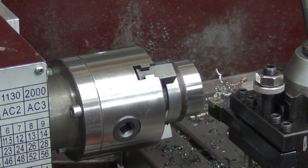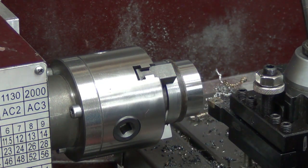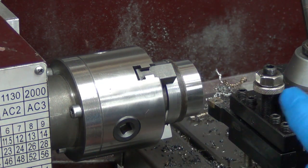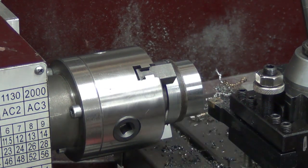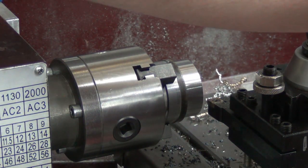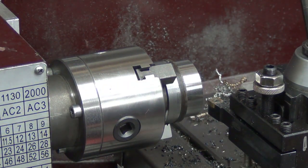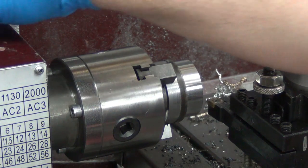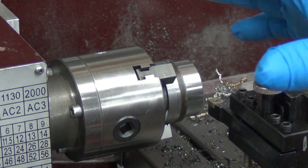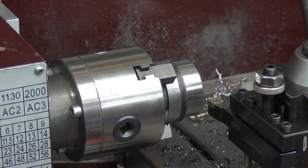I've been playing around with some speeds and feeds and stuff, and pushing the carbide definitely makes a nicer surface finish — holy cow. One thing I did was I changed the pulleys on the sprockets so that now when the motor's maxed out, I'm only getting 600-800 RPMs, so I've got to get another belt or two or something like that.